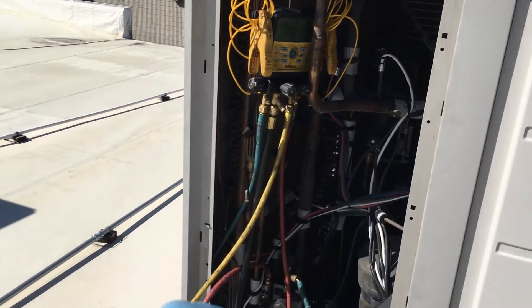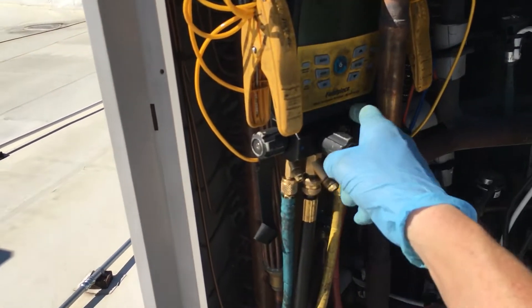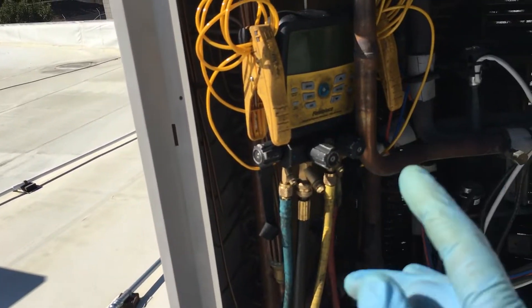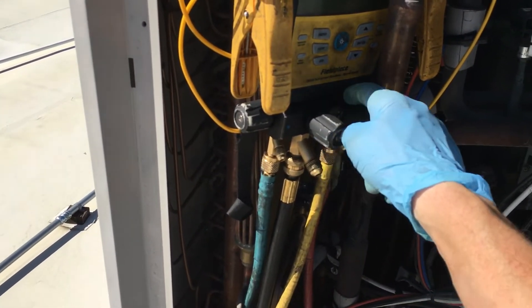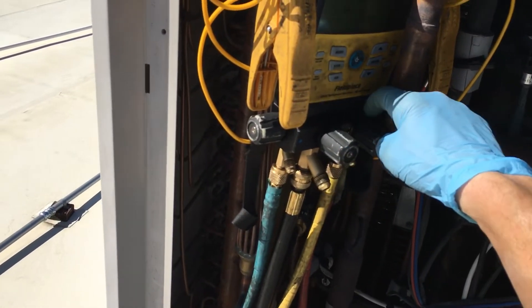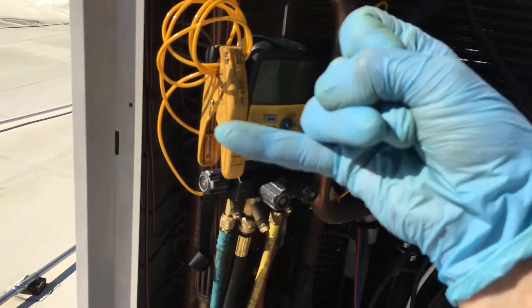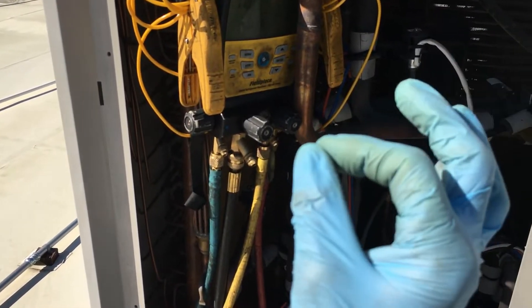If you've seen some of my other videos, especially from automotive, you have contamination from other systems and thin films of oil inside even your manifold, and that's a contamination, especially when it's wet. In many videos I've demonstrated closing the high side and low side and drawing vacuum just inside the manifold, then isolating off the hoses, only holding a vacuum in the manifold where the micron sensor is located. You have to understand what we're measuring — just a small volume about the size of my pinky finger with a little sensor stuck into it.